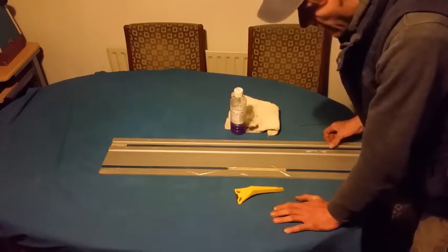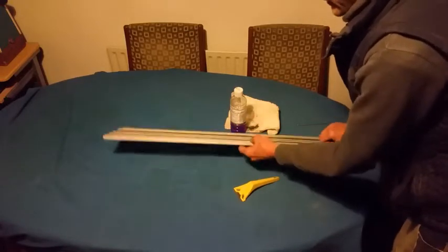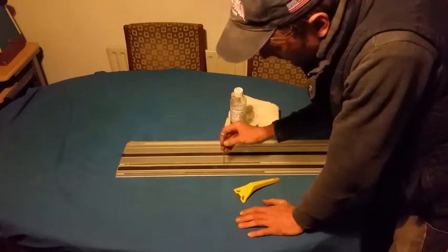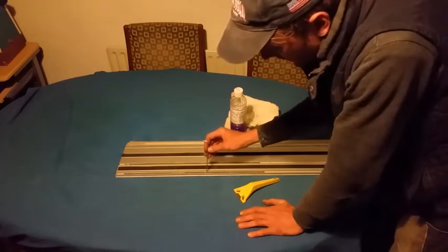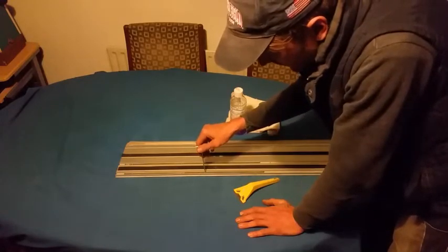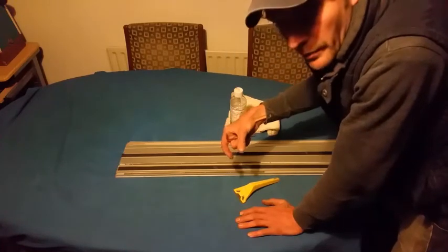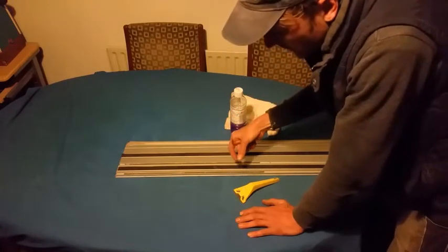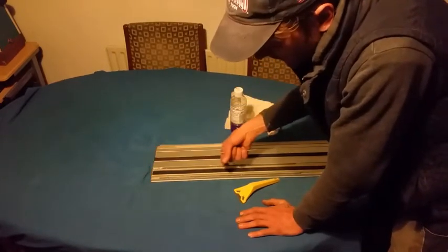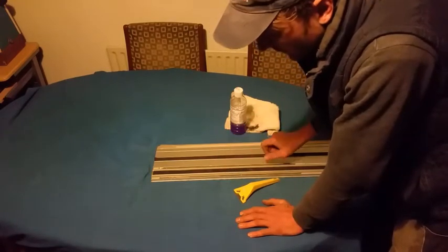In reality I never ever use them. At the beginning I got a bit excited and I made these, which are essentially two thin bars. Because there's two, as you screw the allen bolts in, they sort of push each other apart and they tighten up. So you can loosen them off, slide them into the next rail, then tighten them up and as they do they effectively clamp in position. They work much better than the ones that are supplied.